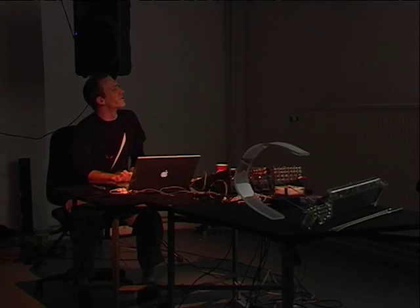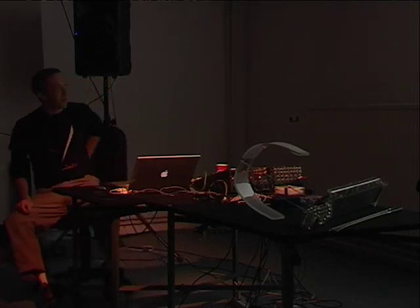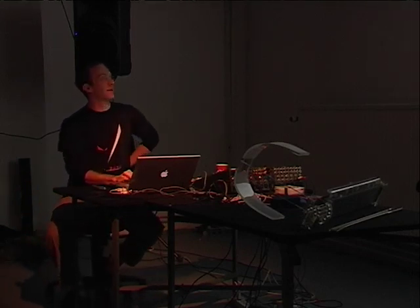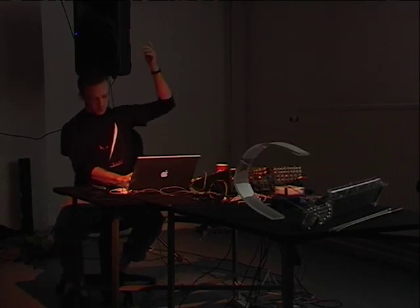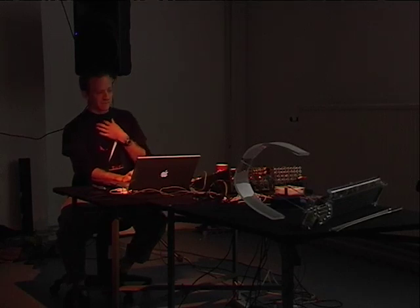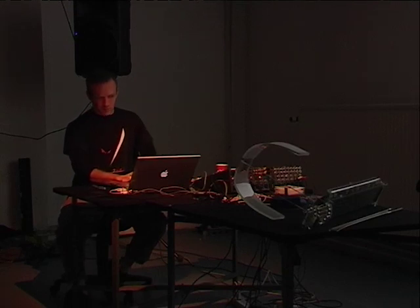So here's a little model of how a microcontroller input pin works. It has essentially four states, although usually people say tri-state, which has three states. The three fundamental states are input, output low, and output high. When it's output low, it's ground. When it's output high, it's whatever your positive voltage is. When it's in input, it's effectively not connected to anything. It's a floating point in the circuit.